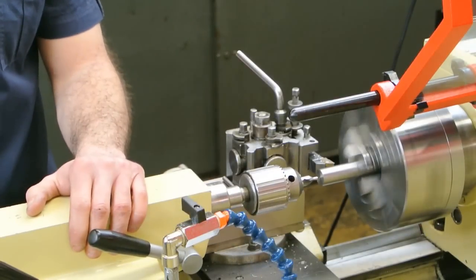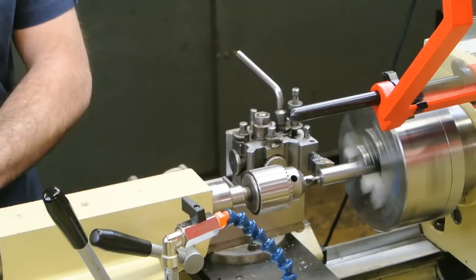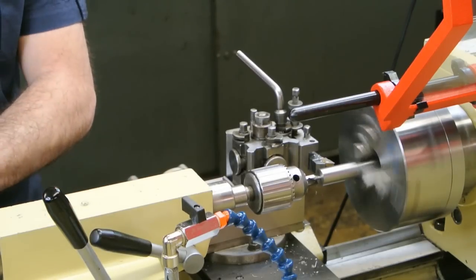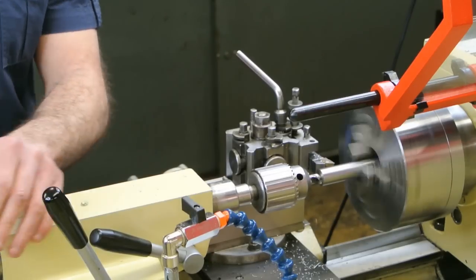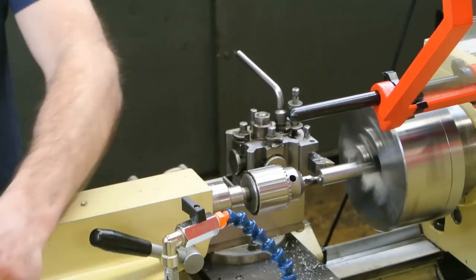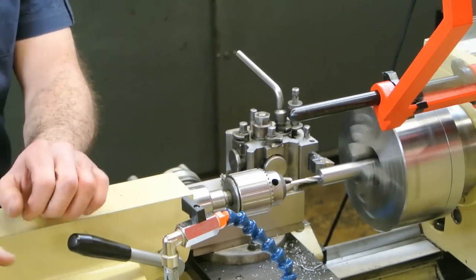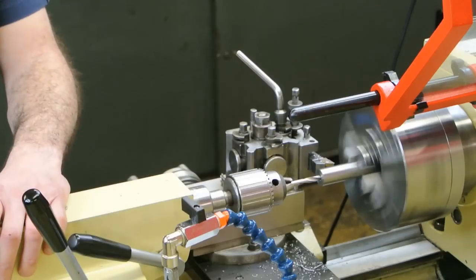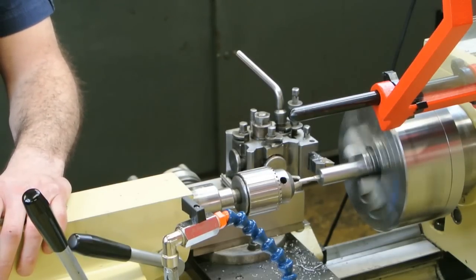Where possible, the centre drill cone should be drilled deep enough to not be completely removed by the start drill, as it makes an excellent guide for positioning the tip of the Ventec drill into the start hole without damage. A start hole is now produced with the start drill to a depth of approximately 10mm, or 1.5 times the Ventec tip diameter, whichever is the greater. The start hole will ideally be within H8 tolerance.